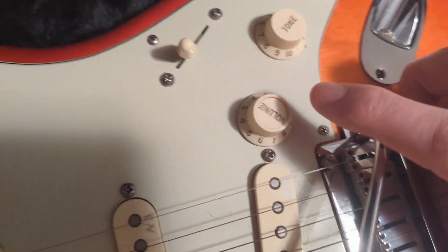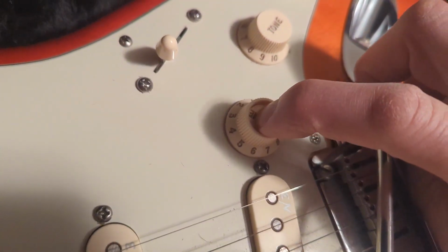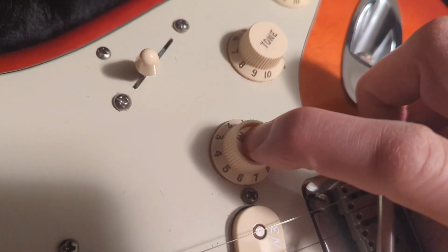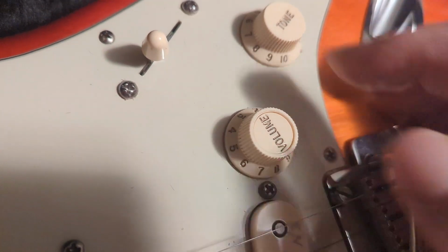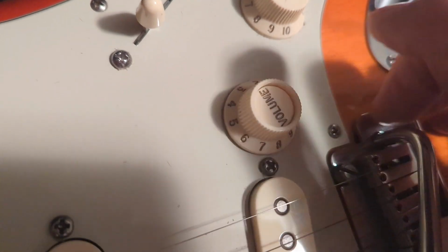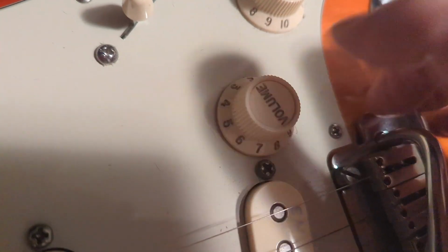And it actually doesn't cover, theoretically, all the combinations that you could have of the 3 different pickups. Again, that's another thing that complicates it. You have 3 pickups in the Stratocaster versus 2 in a Telecaster. It doesn't cover all of the possible combinations that you could come up with. You could technically tear open the circuitry and reconfigure it and cover a couple ones that the existing factory installation doesn't cover.